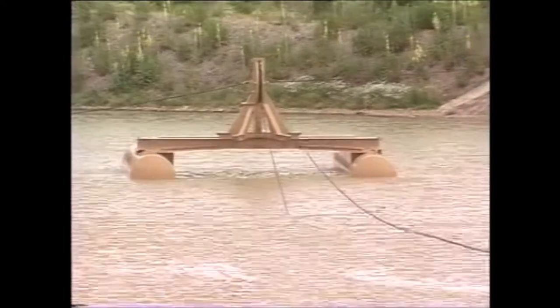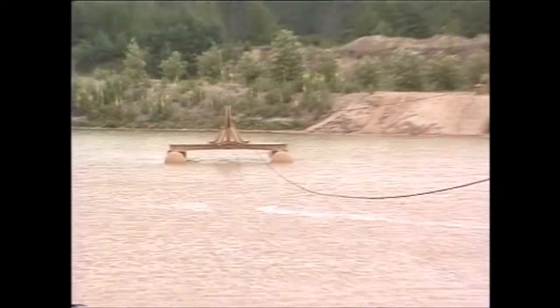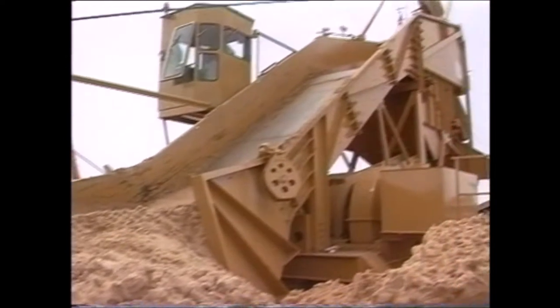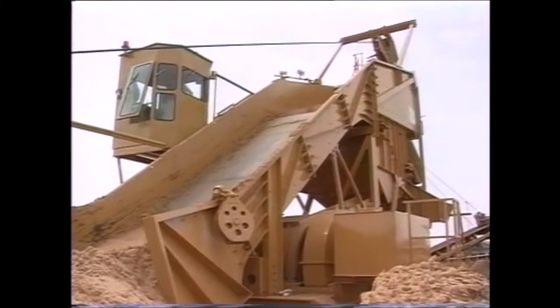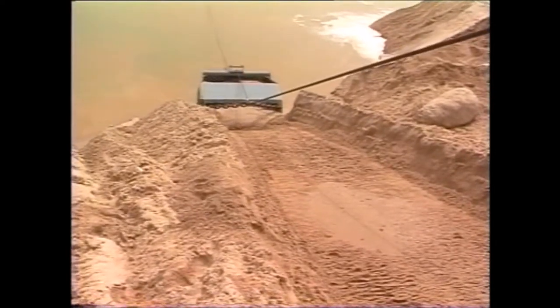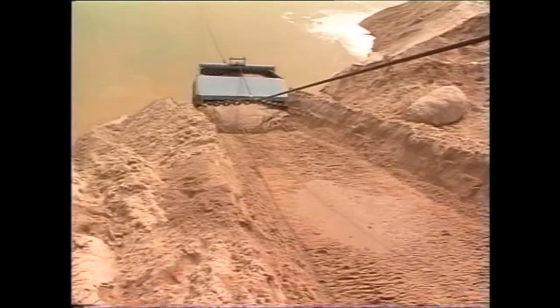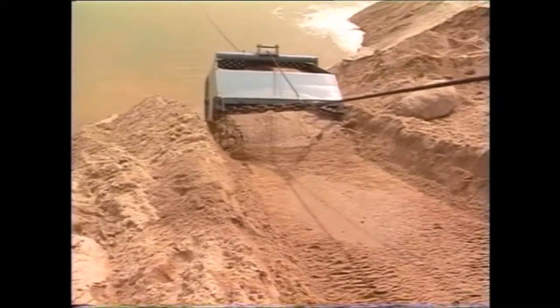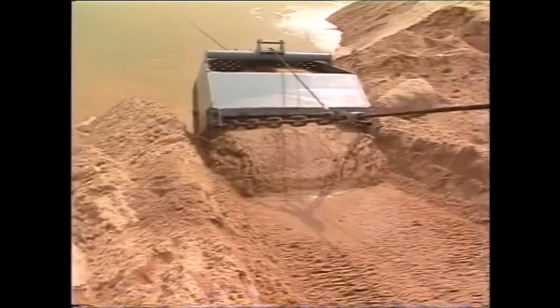As mentioned, the rope is guided to the scraper bucket over the return pulley. The in-haul rope on the bucket is then guided via the return pulleys on the scraper bucket back to the cable winch. The bucket has a capacity of 7 cubic meters and is equipped with lateral wearing skids which, depending on the type of excavation goods in the pit, may be made of various materials including cast steel.